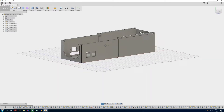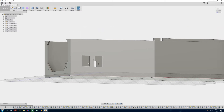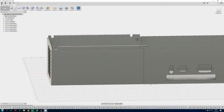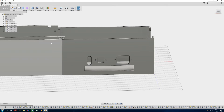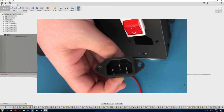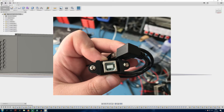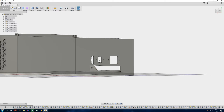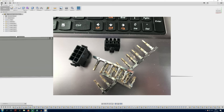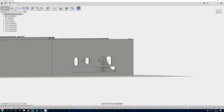Keep in mind I'm not really experienced with Fusion 360. These two spots are going to have power switches, like the ones I used in the old control box. This is the back side — I haven't worked on the panel for the aviation-style round connectors yet, but this section covers the rest of the plugs. There's a cutout for miscellaneous cables, a spot for the power plug, and a USB plug so it's easier to flash firmware. This cutout is for the Molex Minifit Junior — or in computer terms, the PCIe 8-pin style plug.